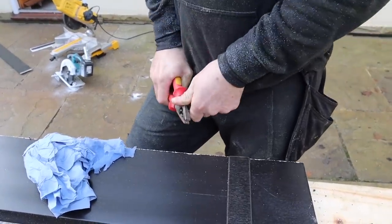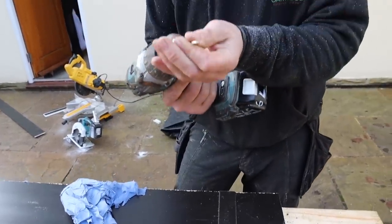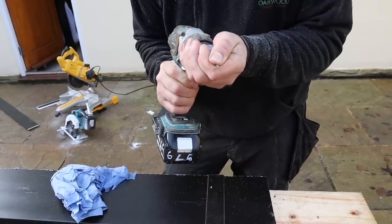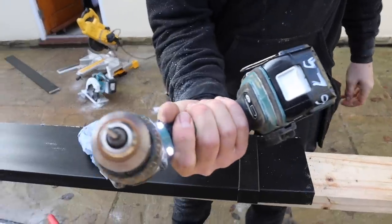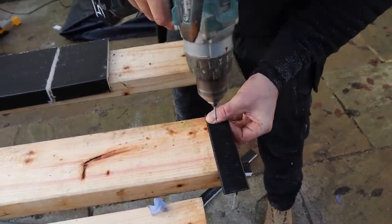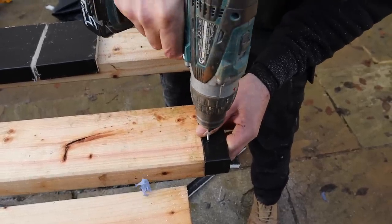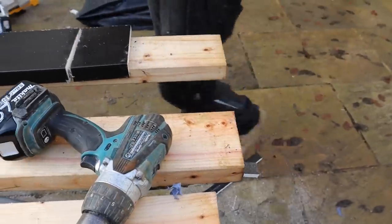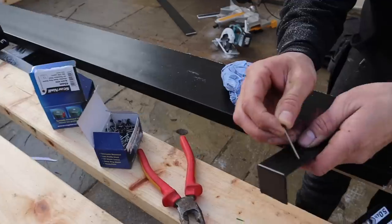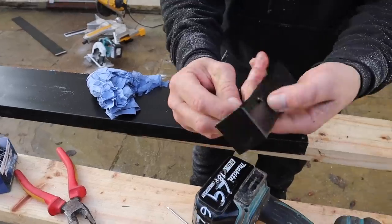Adam says I'm being tight and should buy a little drill bit set — leave a comment if you agree! I've taken the head off a large poly top and put it in my drill. Now I'm going to drill through where I want my poly tops — I'll put two holes in there since the capping will sit over the top. I've now created two holes big enough for the small poly top to sit through without cracking the plastic, which can easily happen when temperatures get near zero. That's a little tip for you.